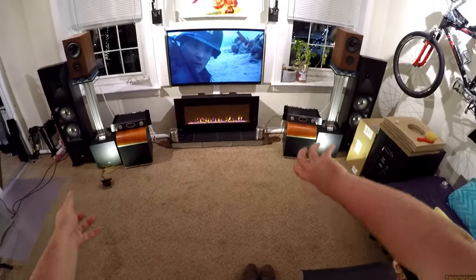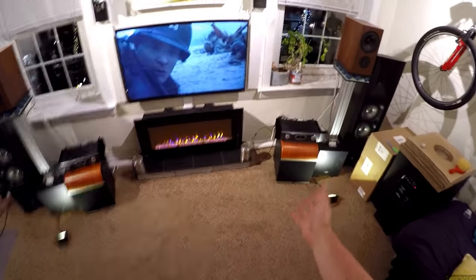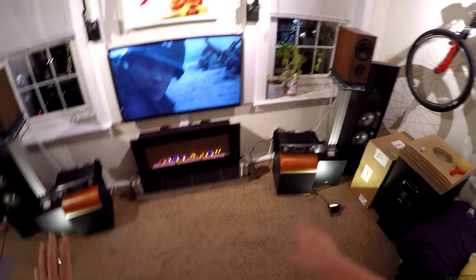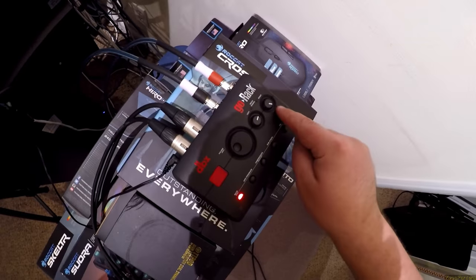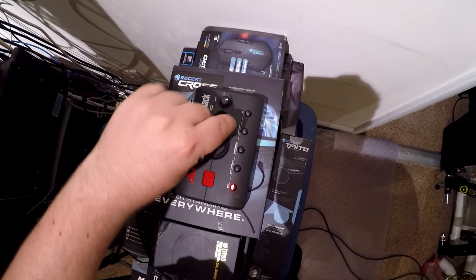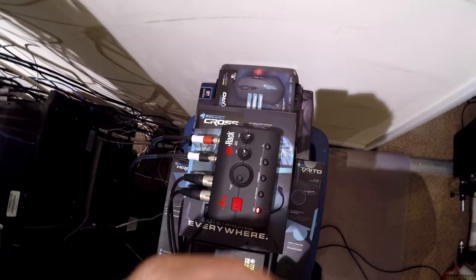So I'm sitting here. I ended up just maxing the gain out in that because there's a slight discrepancy in the power output. It's a $200 amp. If it was a set of Emotivas or an Outlaw Audio, I would say that you could turn them to max power and they'd be identical. But turns out, as you can see here, the right channel is all the way up, the left channel is down, and keeping in mind how fine the resolution is, that's probably like 1.5 decibels cut on the left amp.